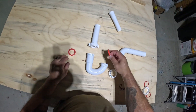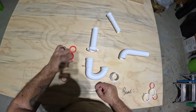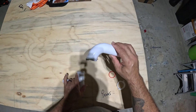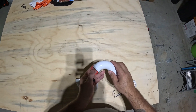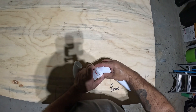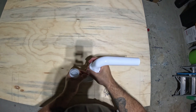The most important parts are the washers: you're going to have a reducing washer inch and a half to inch and a quarter, your flanged washer for your tailpieces coming down, and your standard inch-and-a-half washer. Make sure the cone is facing down into the pipe. The way I like to install the waste arm is I take the cone-shape washer, wrap it around the flange on the pipe, insert it, take your slip nut, screw it in, snug it down — and it makes a really nice watertight connection.